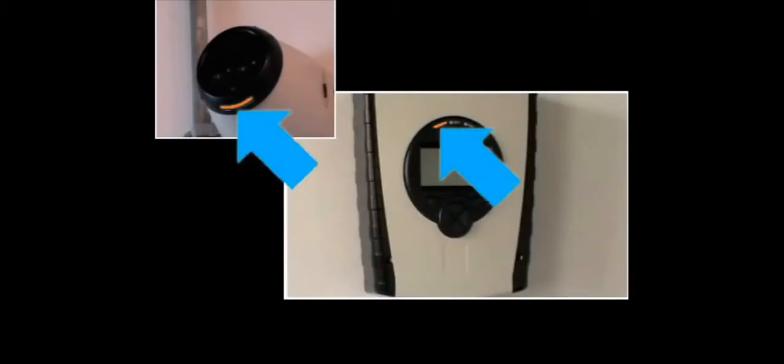In normal operation, the detector LED will flash green. In fault, the detector LED will flash amber, and the LED on the system controller corresponding to the detector head will also flash amber. Similarly, in fire, the detector LED and LED on the system controller corresponding to the detector head will flash red, and if the LCD was in sleep mode, then fire will also be shown.